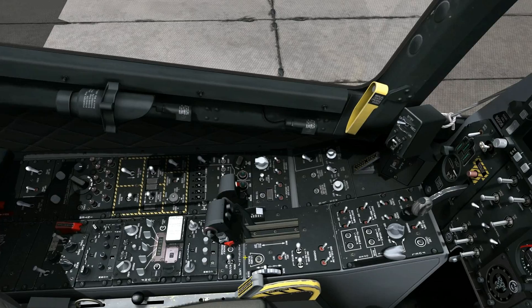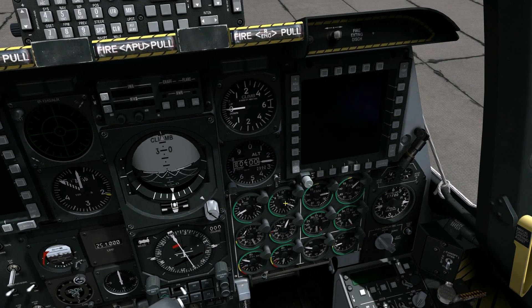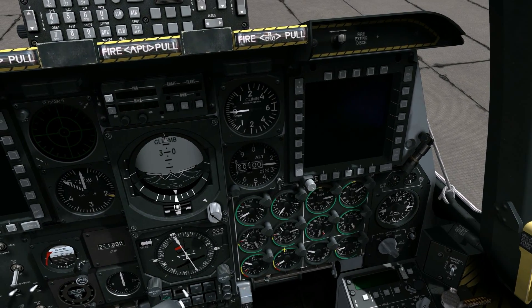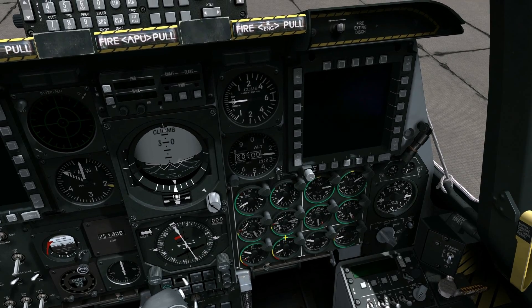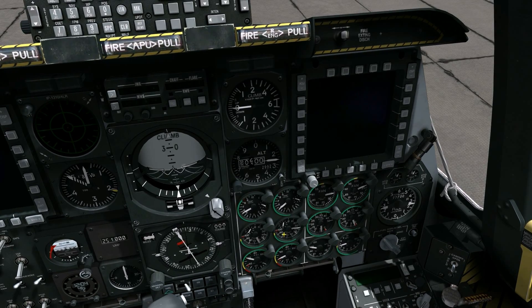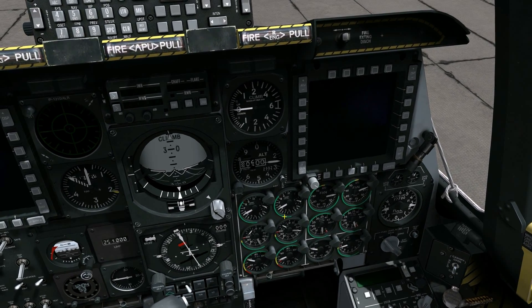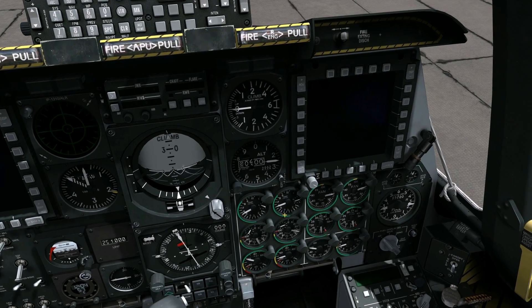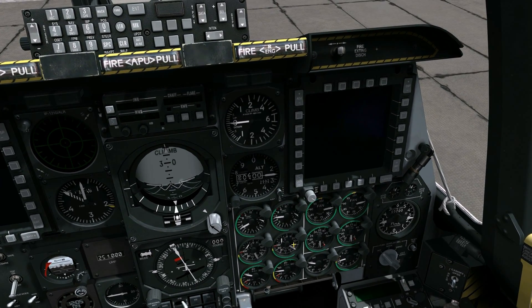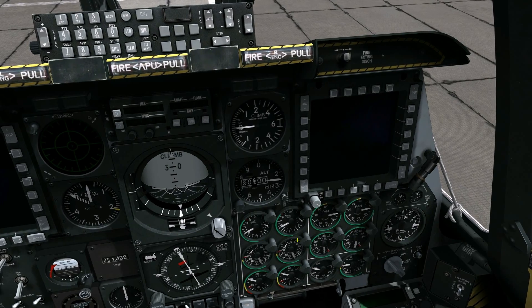62% — good to go, so now we're going to start engine two. Same thing: throttle over the detent into idle. Again looking for an RPM rise, then the EGT surge, and oil pressure coming up. Finally we're looking for a stable 60% on the RPM. I've just got to keep watching this to make sure we don't get any untoward problems with a hot start on the engine. All looks good — the needle's just creeping up a little bit. As the RPM rises it will start to cool the engine with greater throughput of air. We're up to 675 and I'll anticipate it dropping down again — there we go.